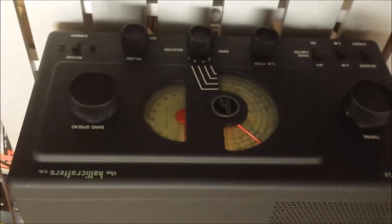One thing on these old radios I want to point out: down here I've got the grounding strap across those two terminals, and then I'm hooking the ground to an earth ground from there. Since we're running a long wire, I'm just connecting this long wire. If you were running a balanced antenna like a dipole, you would take that off and connect to these two terminals here and then connect that to ground. That was probably upside down, but anyway.